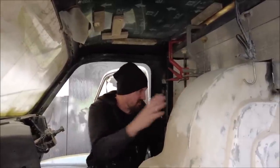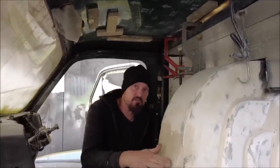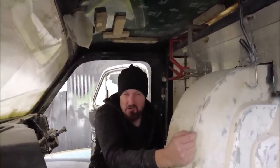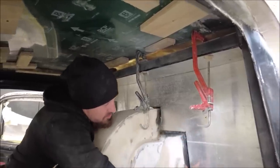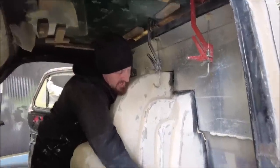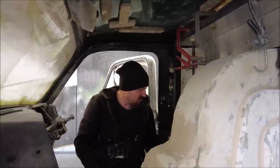After I took it out, I got the doghouse outside and covered it - I'd probably give this about three layers of fiberglass. We want it to be really strong - this is the only thing between the outside and the inside. I've sort of started body working it, because I'm thinking probably this bit will be painted. The seats go either side and everything's so tight in it - the reason this will probably be painted is because we've probably not got the room to upholster it. So the back of the cab, I've boarded over all this so it's smooth. This will attach with a flange all the way around, which I'll mold onto this in fiberglass. And once that bolts into place, that makes the cab waterproof.